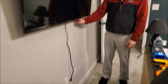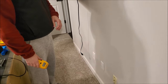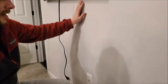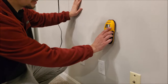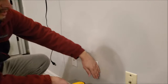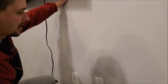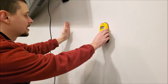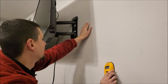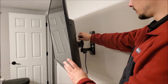What we're going to do is run power from this existing outlet up the wall to a new outlet located behind the TV. In new construction houses, wall boxes are installed on a stud, so run your stud finder to find which side the stud is on. The stud for this outlet is on the right side. The TV is also mounted on a stud, so we can run the cord straight up and put the outlet anywhere in that area.